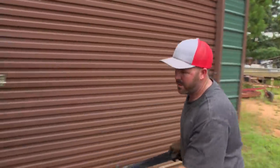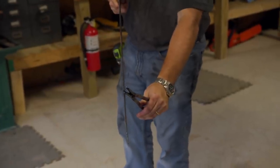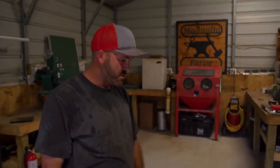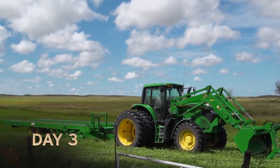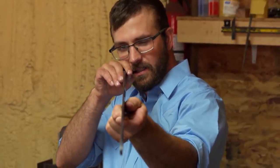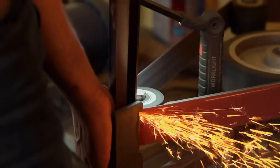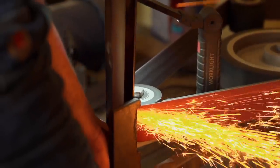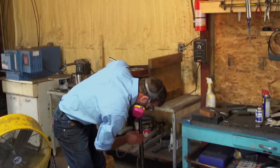I did pick up a slight warp close to the tip. I should be able to straighten that out during the temper cycle, so time will tell. It's the morning of day three. The plan today is to grind in my fullers and get all my fittings ground down and shaped. My biggest fear of putting in this fuller is just grinding right through my blade — I can kind of tell how close it is just by feeling it with my hand. After about an hour, the fuller's done and everything is looking good.